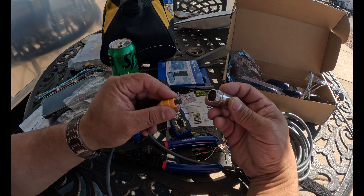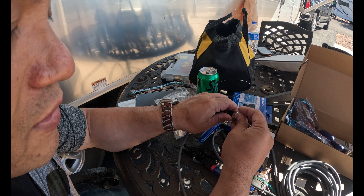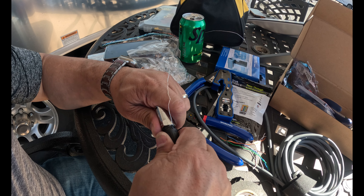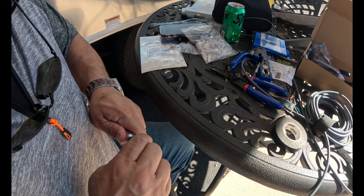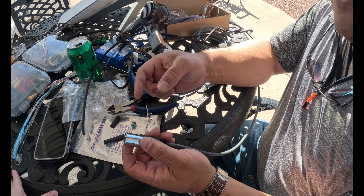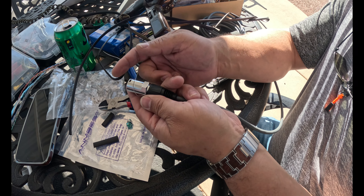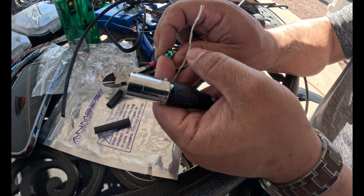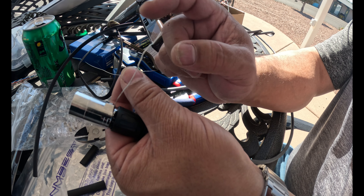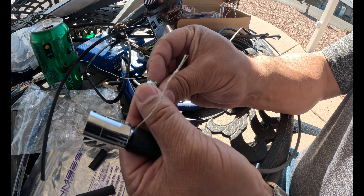This will feed through here. Before screwing this on, I want to protect this portion of the grounding wire because there's a little bit of friction, so I've put a little bit of electrical tape there to shield it. Then I'm screwing this on because this is going to be a tension fitting. Remember, this is going to be coming out all the time — it's going to be plugged into the Airstream end. I still need to ground it, which I'll show when I do it over there. This grounding screw, which conducts electricity, will be screwed into the side of the Airstream. I'll wrap the cable and slide it over with a wing nut.